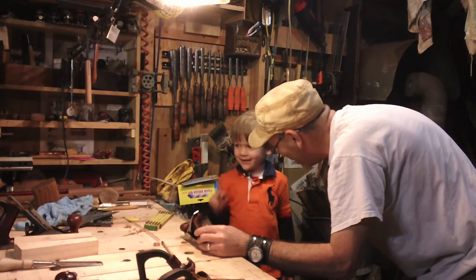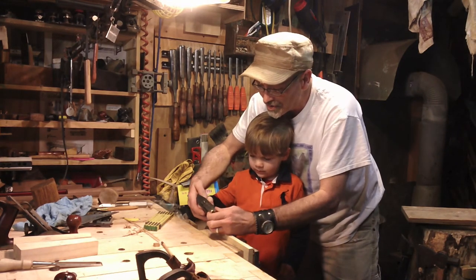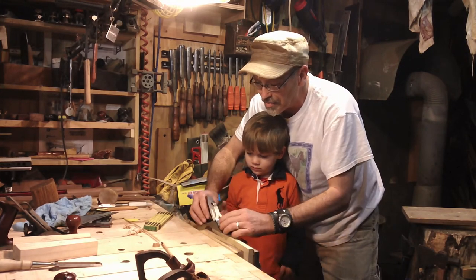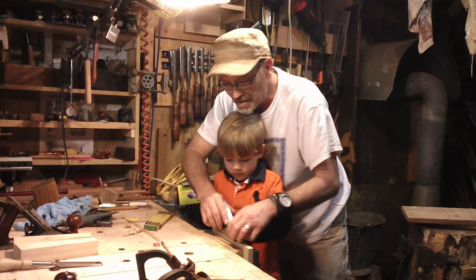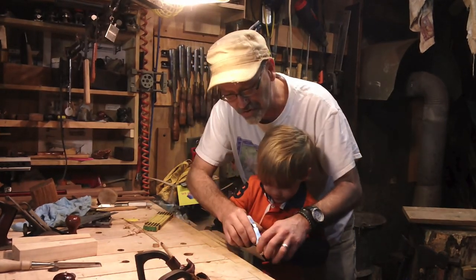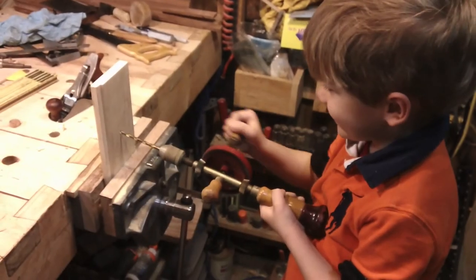What is that? That's a little bitty plane — that's boy size. That's a number one. Let's put your hand on there, wrap your hand around it. Let me slip up — I'm gonna loosen this, pull that plane blade back, tighten it back up, and turn it to where I feel it grabbing just a little bit. So you put this hand on the knob, this hand on the back, push it all the way to the end. Start with pressure here and then finish with pressure in the rear. Start flat and square and straight — push down just like that.